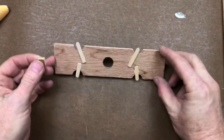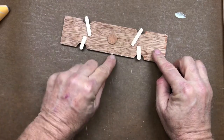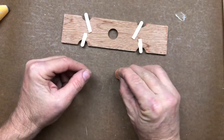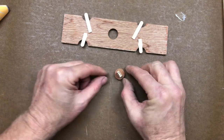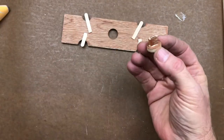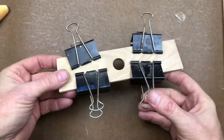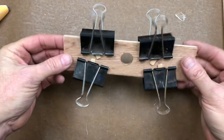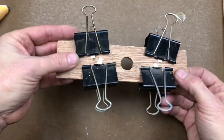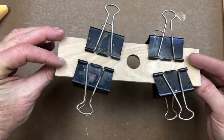While the cleats have been drying, I cut the bung for the hole — the stopper. Fits like a champ. Just use a plug cutter and a Forstner bit, and some glue. I'm going to attach a little handle to my bung, so now I have a little cap with something to grab so I can pull the stopper in and out between coats of resin. These binder clips from the office supply store are maybe the greatest invention in the history of mankind — one of my most used, all-purpose, light duty small part clamps.